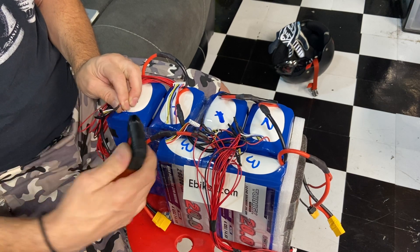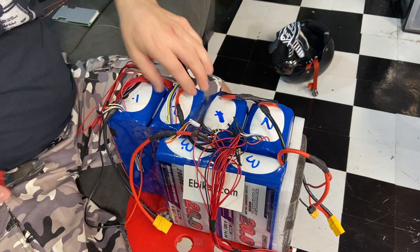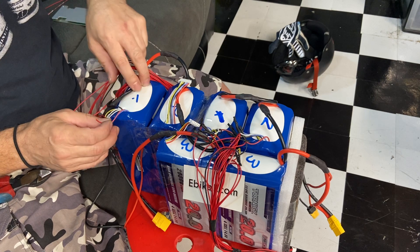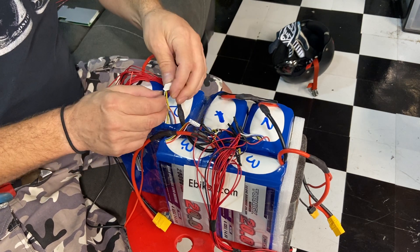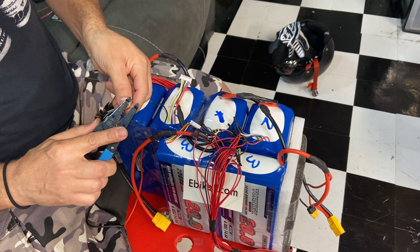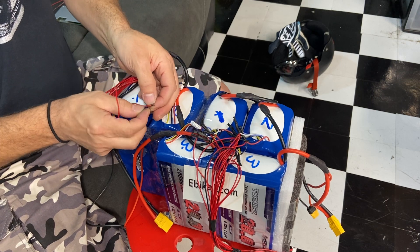You always have to solder them because it's like glue — so it doesn't come loose. There are vibrations from riding and everything, so it's really easy for a wire to come loose — that would be a real bummer. Now I'm on a 6S brick; this is number 7, it's red. When you go from brick 1 to 2, you take the red wire and the black wire and they have to pair together. If it sparks, you know something's wrong. Mine are in order — that's why I numbered them. If it doesn't spark, that means it's correct — the same voltage.